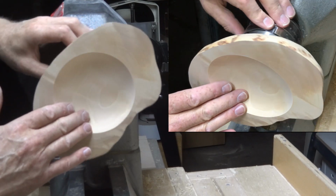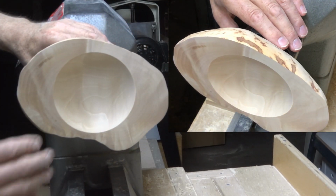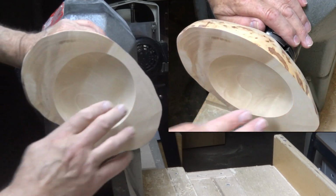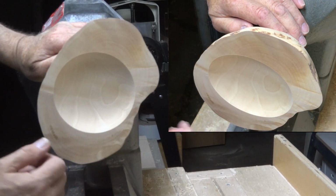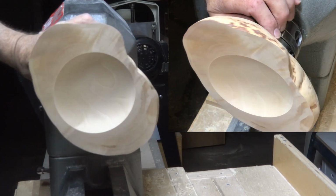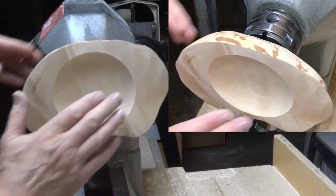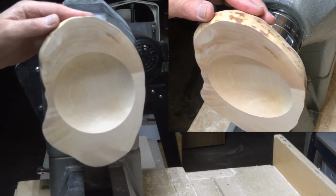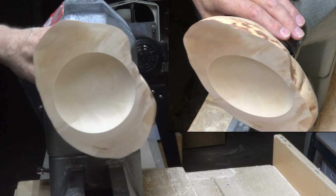I've sanded the bowl up to 280 grit, basically because I forgot to stop at 240 grit. I want the bowl to be a little glossier than the rest of the piece. So I'm going to use Tom Ackley's Axe Abrasive Paste and Axe Polishing Paste to do the interior of this. Then I think I will put some Shellawax on it as well, possibly to get an even better gloss.